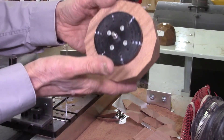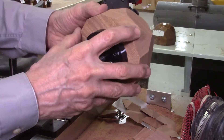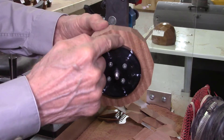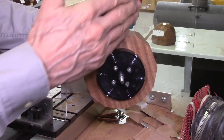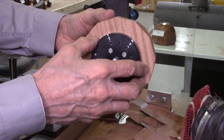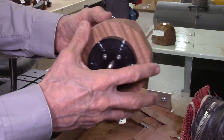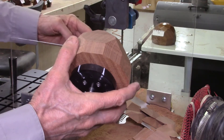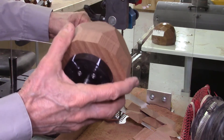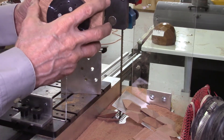I also have my 90-degree facet, and the last one I'm going to do is actually a 110-degree cut so it tapers inward to get a nicer face on the clock — a little bit smaller face rather than one big flat face. My normal AccuFacet plate goes from 0 to 90 degrees, so to get beyond 90 degrees, I move the screw to a different set of holes on the plate — moving it over one position to use those positions. That gives me a cut at 110 degrees, providing a 20-degree taper.